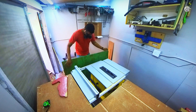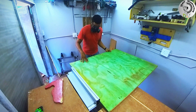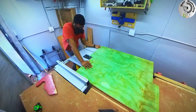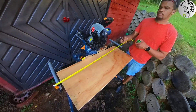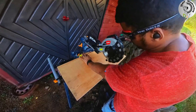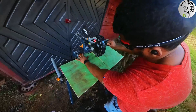Let's start things off by making the hexagon pieces. We will need four of these hexagons. You need to cut up two strips of plywood of 39 by 100 cm dimensions. We will make our hexagons on the mitre saw — I found this to be the easiest method, especially because it doesn't need any special jigs. So we'll need to cut down our 100 cm board in half.